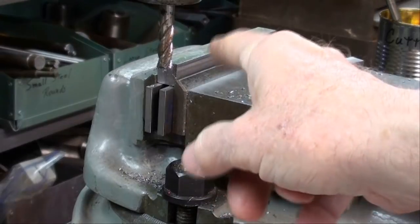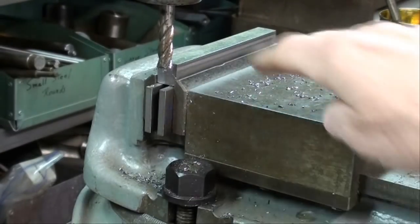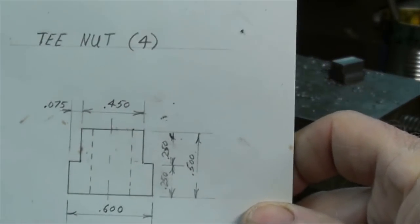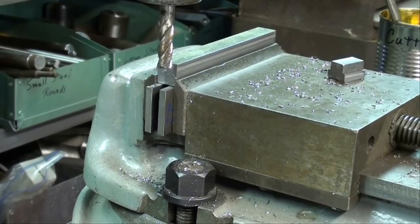I have remounted the work on an adjacent side. I took the parallels out, wiped them, cleaned the inside of the vise, deburred the work because there were burrs from the milling operation, and I got my glasses back on. Now I'm going to reduce this side to five hundred thousandths. I'll take three passes — perhaps seventy-five thousandths off the first one, then work my way down and take off just ten or so thousandths as a finishing pass. I will locate the depth of the cutter the same way, although it should be about the same as it was for the other side.